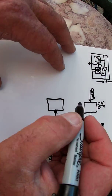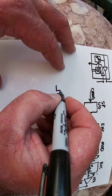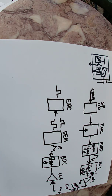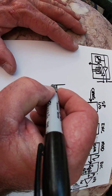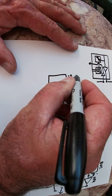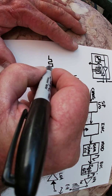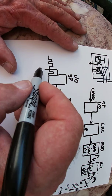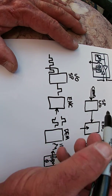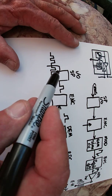That encoder may change it from one type of data format at the input to a different type at the output, either logic levels or the way they sense data. Then coming out of that encoder, you probably have, like the reverse of this, some other kind of signal processor, interface board, maybe some filters, and there go your data bits marching out to the controller, saying, here's a command, turn left, whatever. And basically that is the vTX chain right there, and that's the receiver for the DJI FPV radio controller.